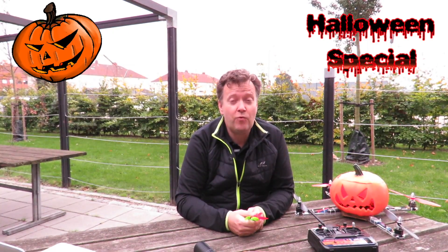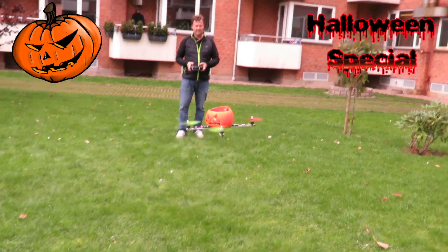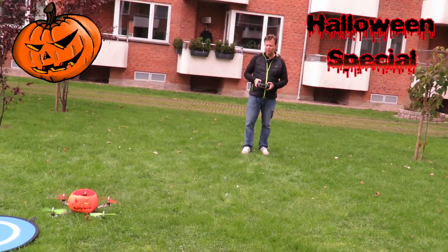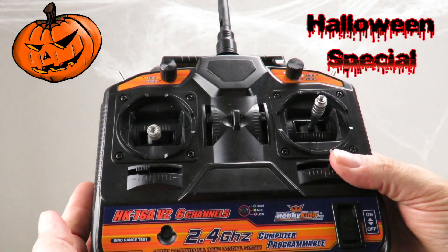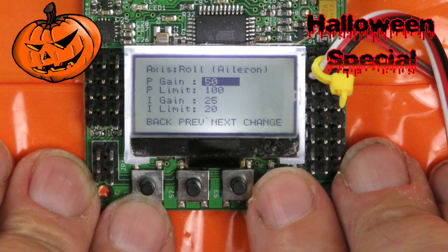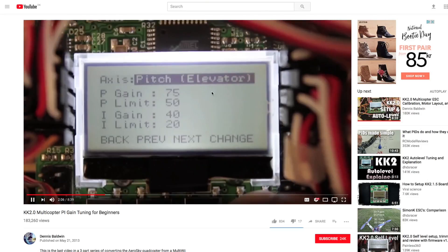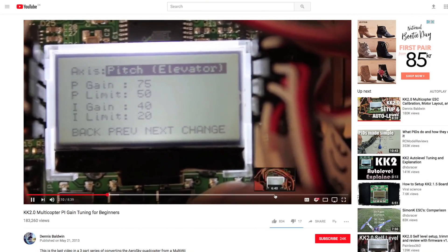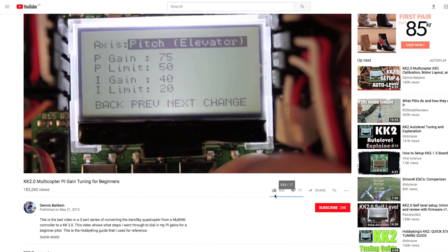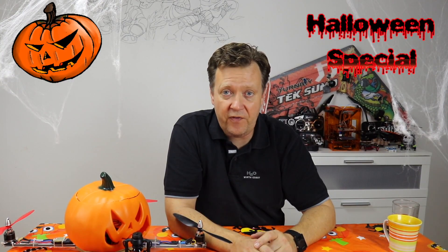The goal of today is to make the drone hover and adjust it so it doesn't drift too much. Remember, this drone does not have any GPS to help hold its position — any drift needs to be corrected through the remote using the trim handles. We may also need to adjust the PI settings on the KK2. I ended up using recommended PI settings from a guy called Dennis Baldwin, who built a quad with identical components. Link in the description. You might need to adjust further — it's not difficult, but it takes time to get it perfect.